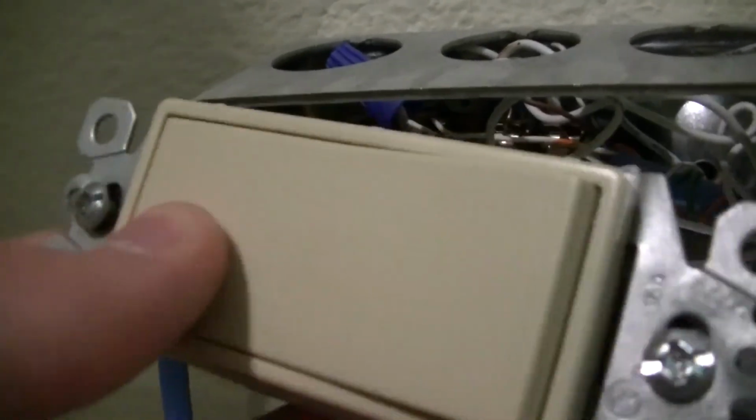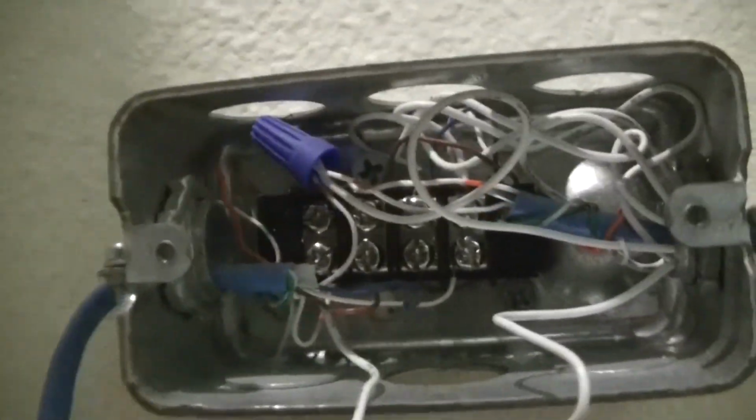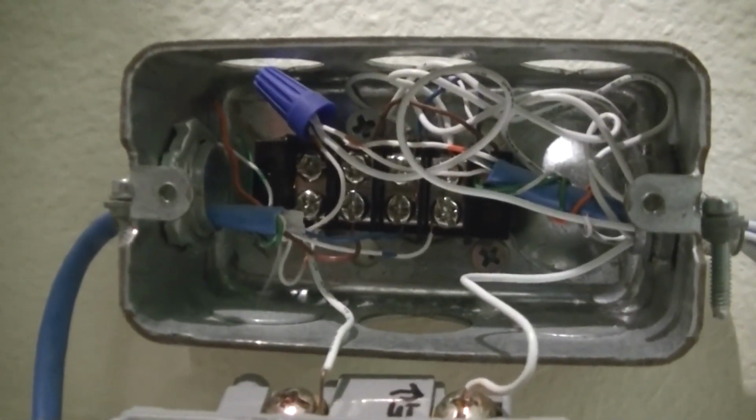And then a light switch to control the hallway audible. But seeing as I have 4 NACs now, I can control the hallway audible straight from the panel, so this whole switch assembly isn't going to be necessary anymore. But I do have other plans in mind for the junction box, so we'll see how that goes. Then I'm going to continue pulling more cable out and going from there.